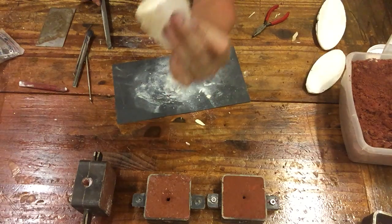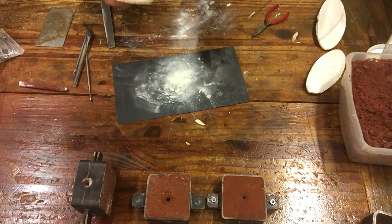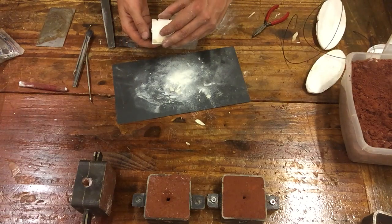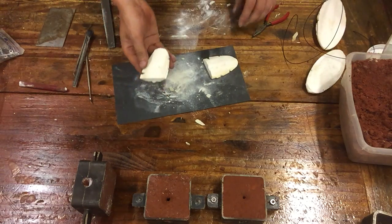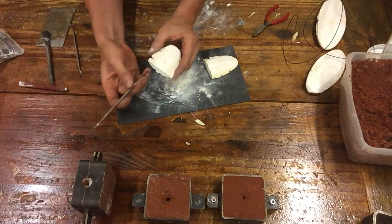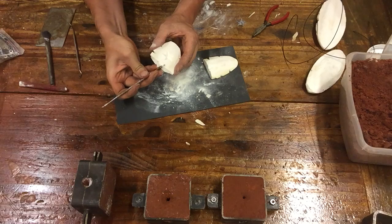You can see it's locked in on all four sides. While keeping everything together, we know that our wire work will be able to be wrapped around this cuttlefish. But we still have to remove our part and then cut a place for the metal to flow in through the funnel directly to our star. So I'm going to carve away that opening to make a nice funnel shape.